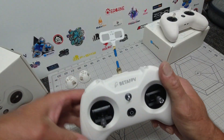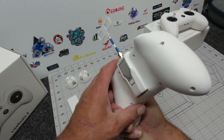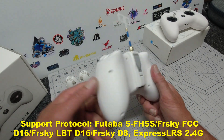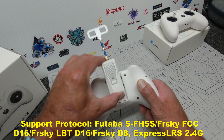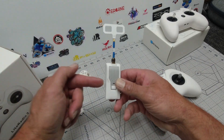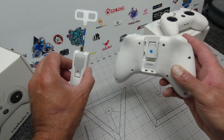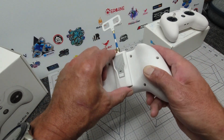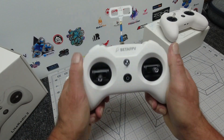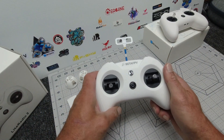What I would do is go for the 2.4GHz ELRS, as that is exactly what this radio is designed for. It sits on the rear and we now have the ELRS system ready to go. This version has ELRS built in, but should you get the FrSky version and want to use the BetaFPV ELRS system, grab one of these little modules — they're really well priced. Links are down below. If you are going to run a module on the back, you'll need to hook this up to the BetaFPV configurator, which is quite easy to do.